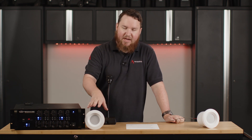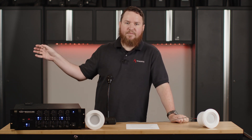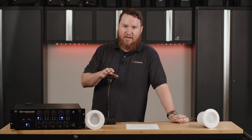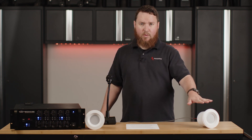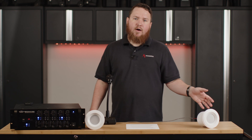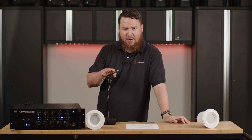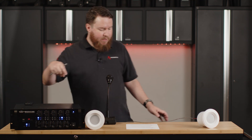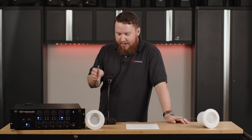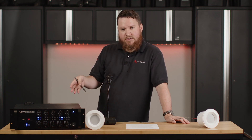This mixer may be controlling a dozen or so sound masking speakers inside of an office where this microphone doesn't need to page, but it does need to page to the speakers on this wire run — this zone of this mixer amp — to communicate with the customers. If I need this to be an emergency microphone to page to everybody, all I have to do is configure the zone assignments here. That's how you configure an analog paging microphone with an analog multi-zone mixer amp system.